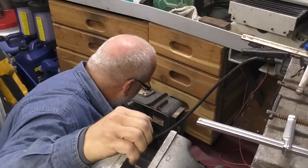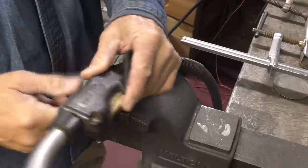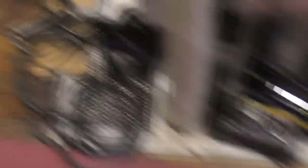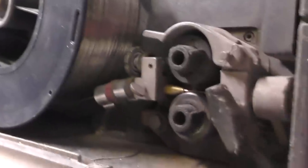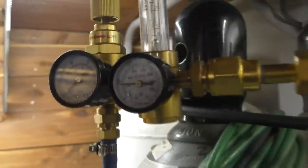I'm going to open the tensioner on the wire feed so I won't get any wire out. I'll wire my trigger on to get some gas feed, start back up, and come back here to check my gas flow. I've got gas, but no flow, so there must be something wrong with the switch. The ball should be up — I think something may be wrong with the regulator.